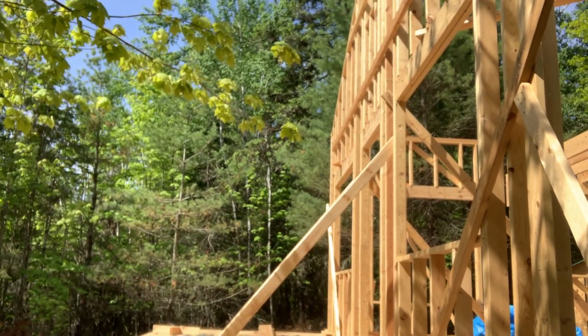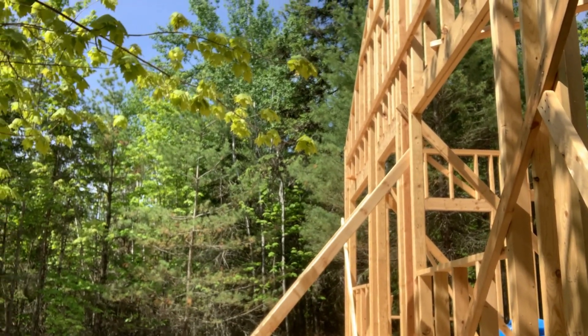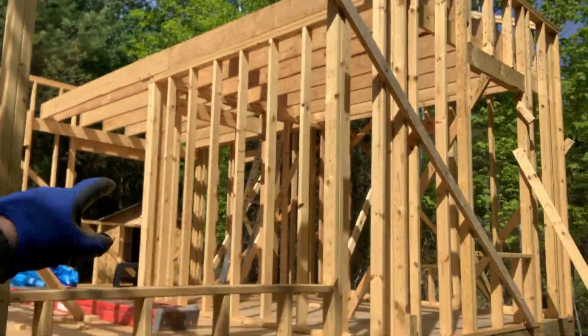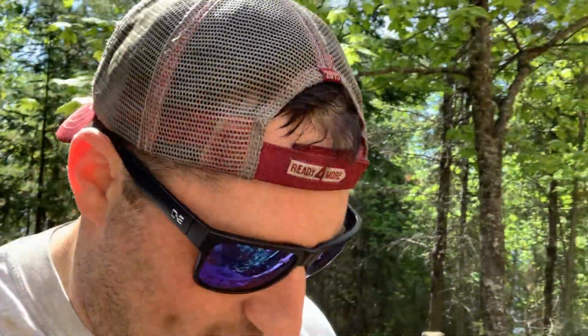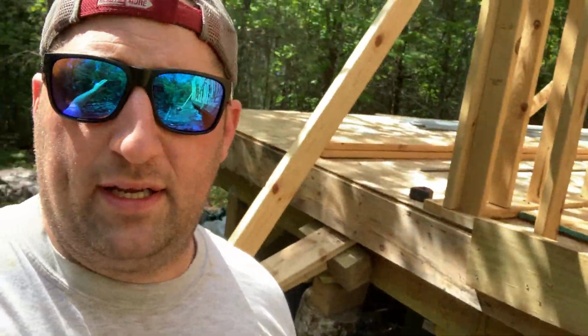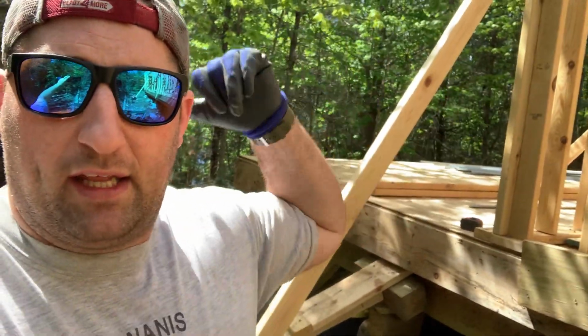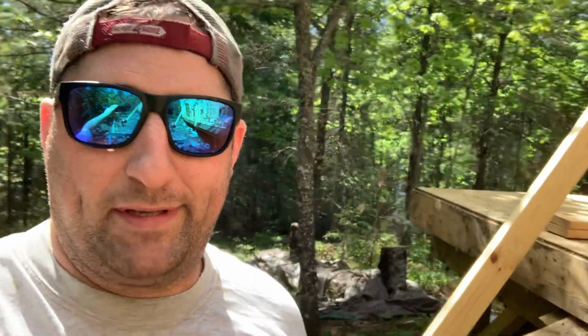And of course I'm going to have siding as well. So that's the reason for that. I'm going to block the back one as well, because that's also parallel to the joist. And that should at least just help me out a little bit, distribute the weight, make me feel better. So I just got to cut a bunch of pieces for that. I'm going to cut 2x10 pieces and crawl underneath there and put them in. And then, as soon as I'm done with that, which should probably take me an hour or so, I'm going to start carrying some OSB and start wrapping this sucker. All right.